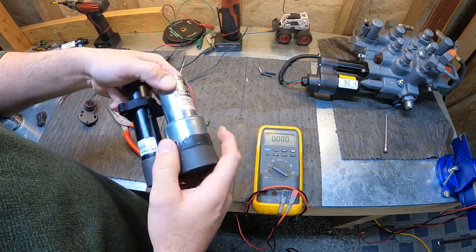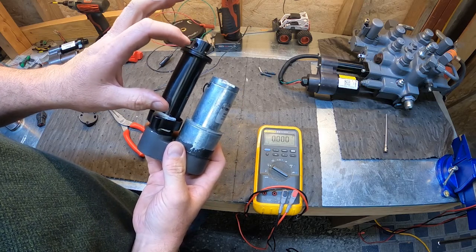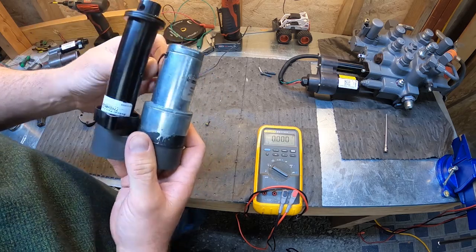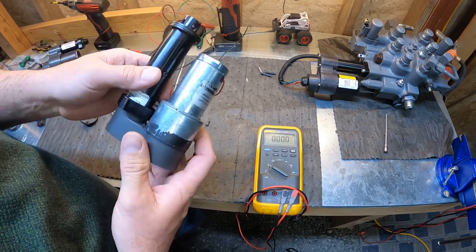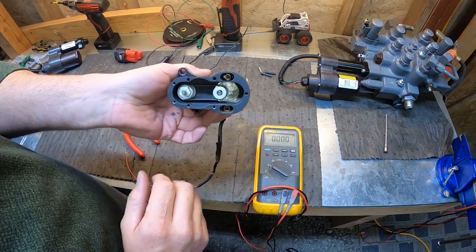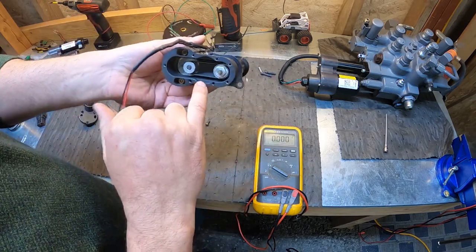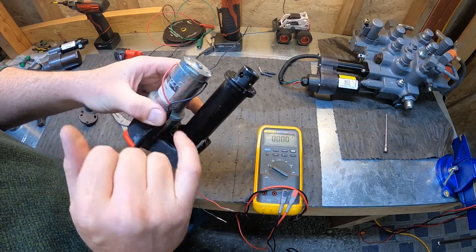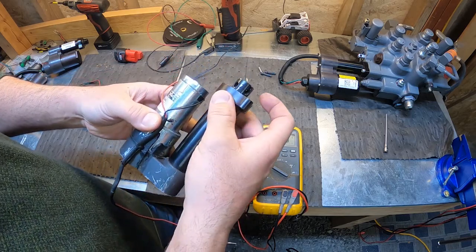This style gearbox and belt drive is a slower actuator. This is 2.6 inches per second, where the newer actuators, which we call a flip actuator, is 4.2 inches per second, because instead of having a motor gearbox, the gearbox is up here, but we'll get into that in a minute. So common failures are belt cogs missing, broken belt, usually brushes in the motor itself, or the bearing here in the end of the ball screw actuator.